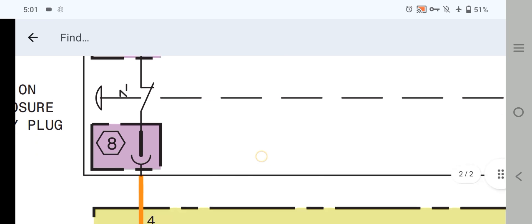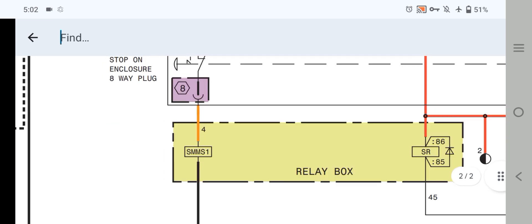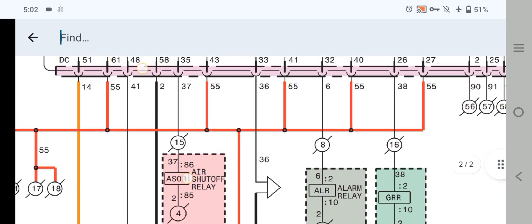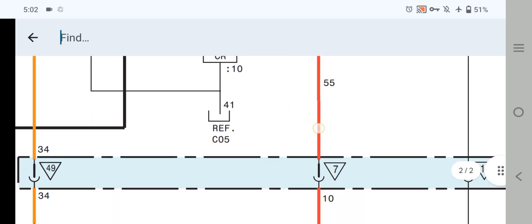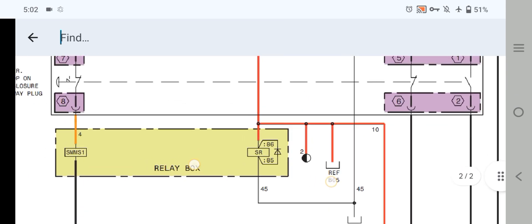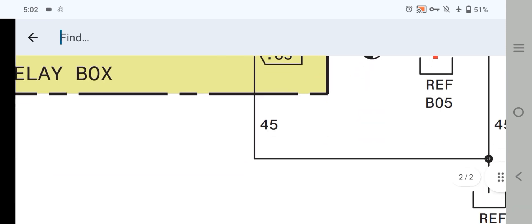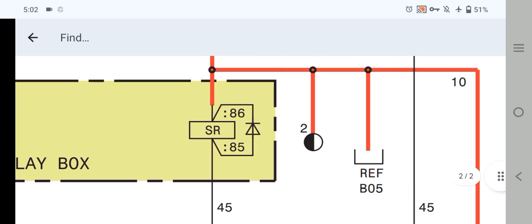Out from the emergency push button NC contact, the circuit goes to the starter motor solenoid terminal. The engine then cranks, turns over, and starts. This is the starting circuit. Following the positive wire from the starter relay — wire 55 goes to the 70-pin generator connector, inserted to pin 7, and wire number 10 comes out as the relay coil supply of the starting circuit. Pin 86 is the battery positive signal from the EMCP controller, and pin 85 is ground.